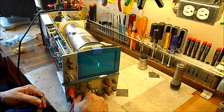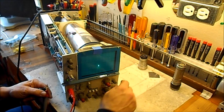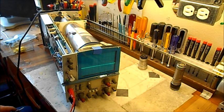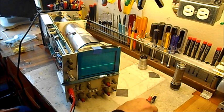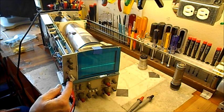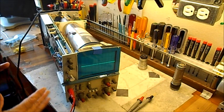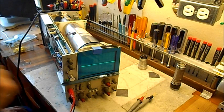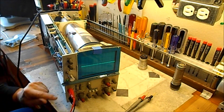I'm just monkeying with this thing. Now I don't have that vertical anymore — see how that went away. I've got position control again, the trace is staying on, I have sweep. What I'm going to do is go back in, open this up, restrain some wires, maybe find another switch, and rewire this Y input circuit for the vertical axis. I was really happy it came back to life after I changed the caps. Now I'm back to having some issues with the vertical control and stabilization regarding this switch when you go from high to low.